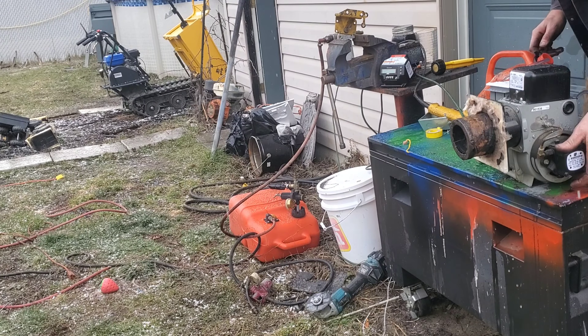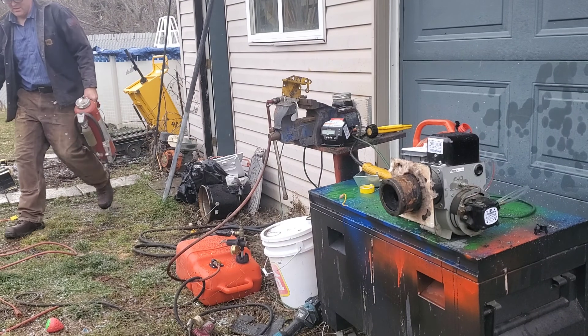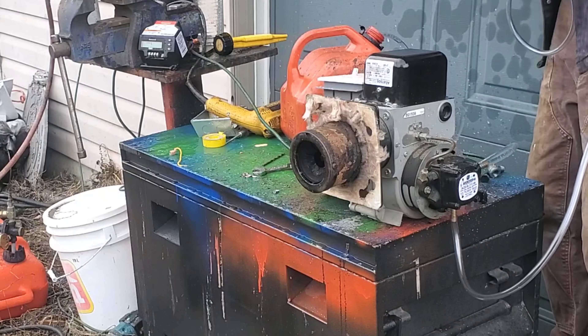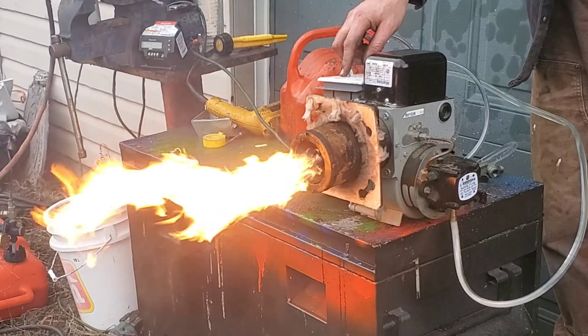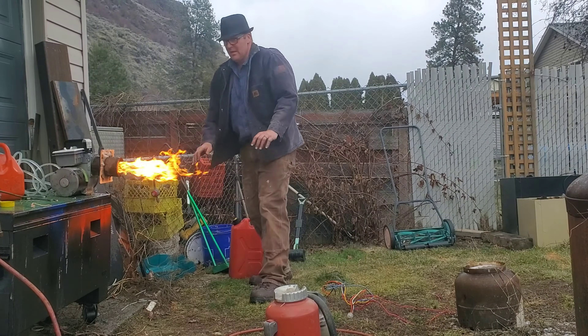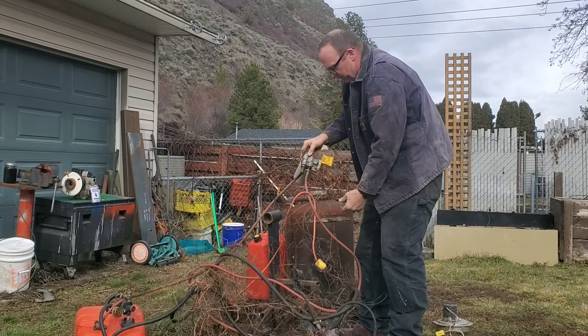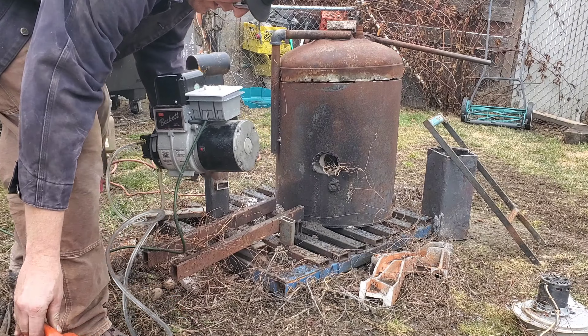Can anybody spot the safety violation? That's not water running off of there — that's diesel spewing on the bottom of the bypass valve. Let's go grab a fire extinguisher before we actually burn this place down. Now I've hooked the bypass hose back into the diesel container. I fire it up and would you look at that — diesel and bubbles flowing back through there. Off camera I had actually put a plug in thinking it would work, but the motor wouldn't turn over because the compressor was pushing too much pressure. Super important to have that bypass hose returning to the tank.